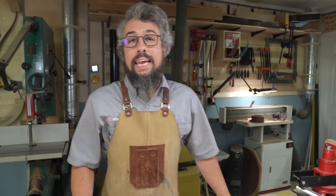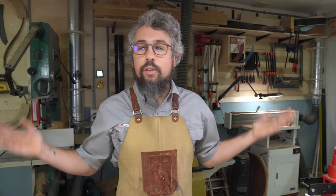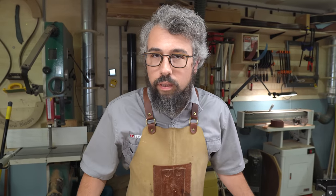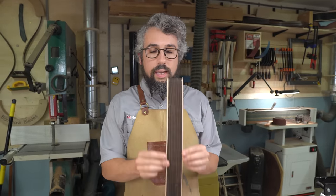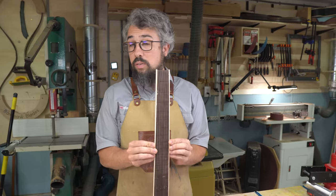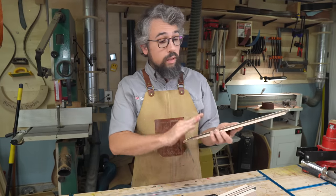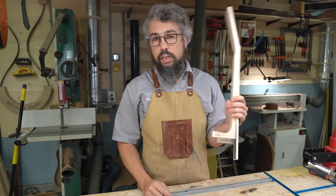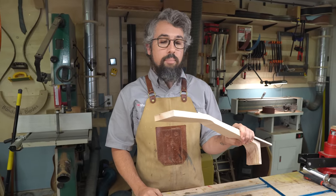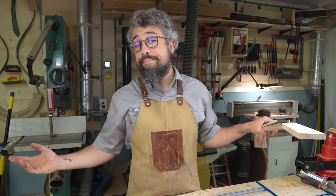Welcome to Triple Guitars. My name is Chris. Behind the camera is Matt, as always. And it's another episode of the 3,000-year-old guitar build. We're finally into the neck. What we have to do today is to take the fretboard that we previously bound in the last episode, and we're going to thickness it, radius it, and then get it glued onto the neck so that we can finally get this neck bolted onto the guitar. So that's what we're going to do — it's the next step.